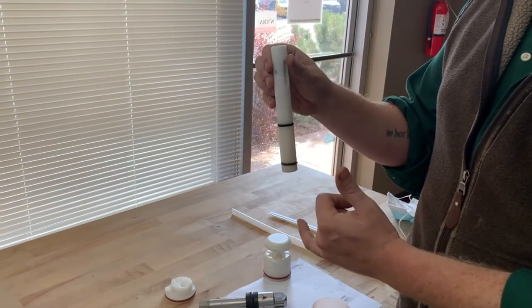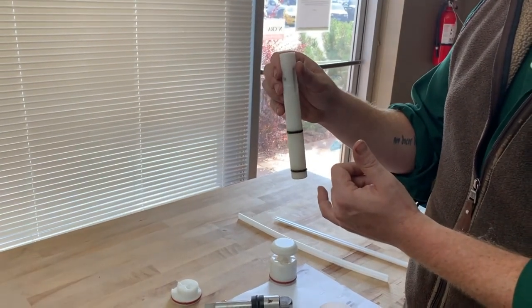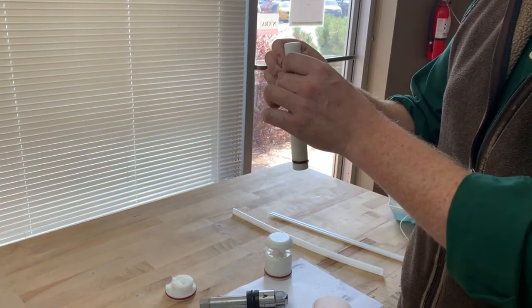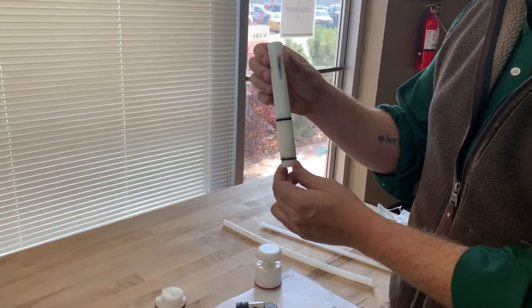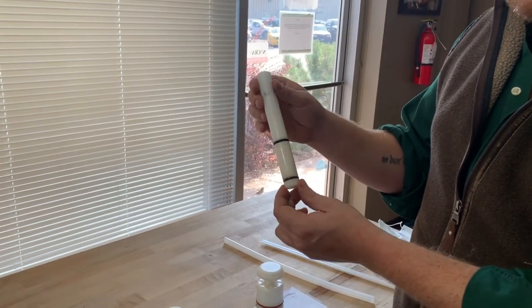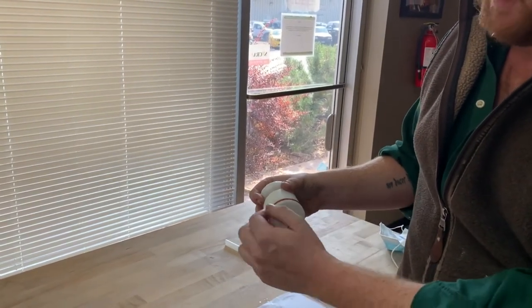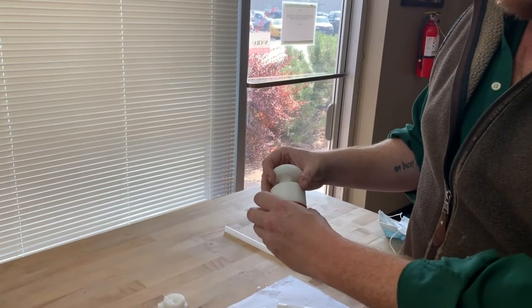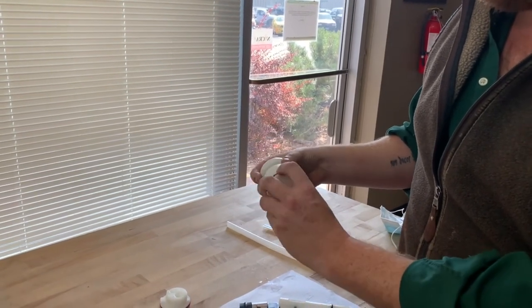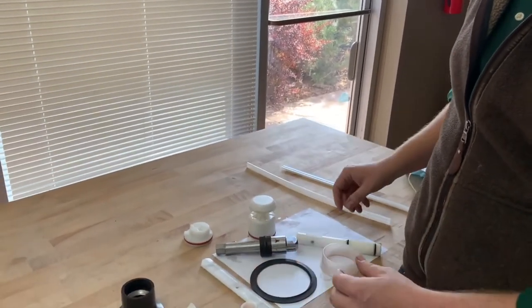The plungers themselves can get worn too. After many years, like 5+ years, the plungers themselves may need to be redone. And they make plungers that are a little bit bigger from Taylor for special tune-ups. But check that out, and always make sure you're checking your O-rings. Make sure you're checking any of your pump parts. All the O-rings and pumps are super important. It doesn't matter what brand it is, Taylor, Stolting, Carpigiani, Electrofreeze, you need to make sure that you have good O-rings that are new and are sealing, because if they're not sealing, the pump can't work.